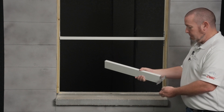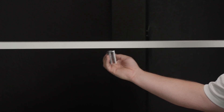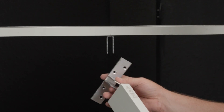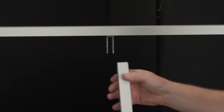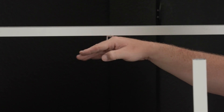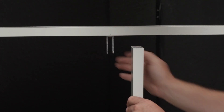I'll need my U-clip and my T-clip. The first step is to pre-drill and fasten this U-clip to the horizontal mullion. I'll find the right location and anchor it. I'm ready to slide on the T-clip — one side of the mull bar and the other side is going to fit right over this U-clip. If you have troubles getting this mull bar to slide over this U-clip, you're going to have to loosen one end of the mullion to slightly raise it up so you have enough clearance to slide this mullion completely over the U-clip.